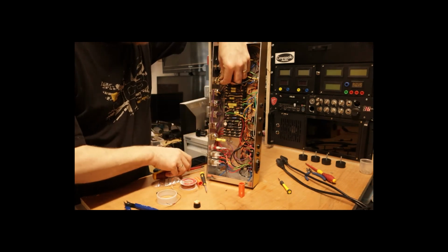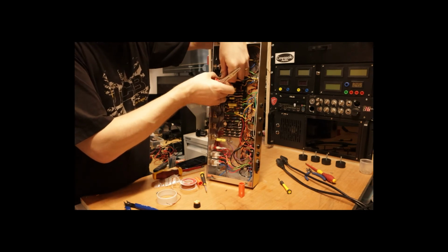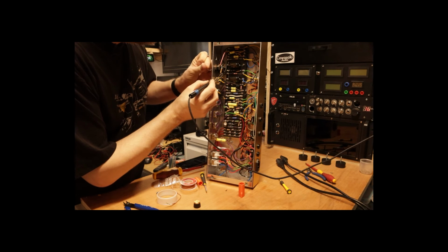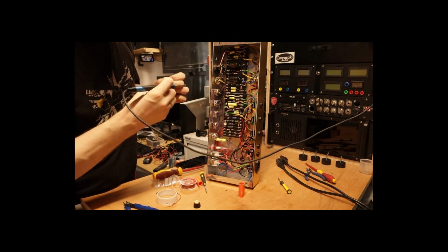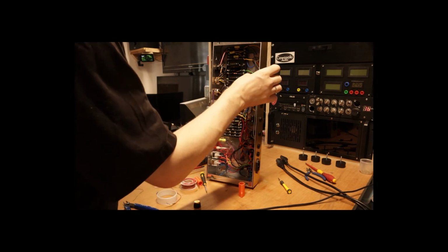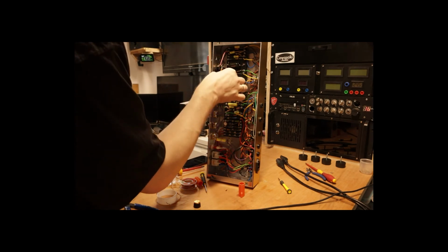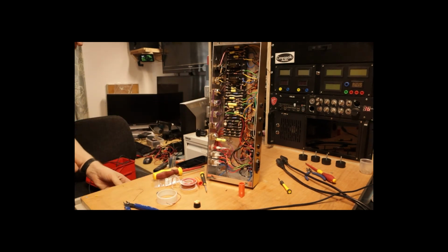There's an art to soldering while filming, which I will no doubt learn eventually. Now, just looking at this, obviously I need to connect the shield to ground. So what I need to do is find a ground for it. Now I'm looking at this wire here and thinking about it. I think that, yeah, this goes to the negative side of the capacitor. I believe this wire does come from a decent ground connection.